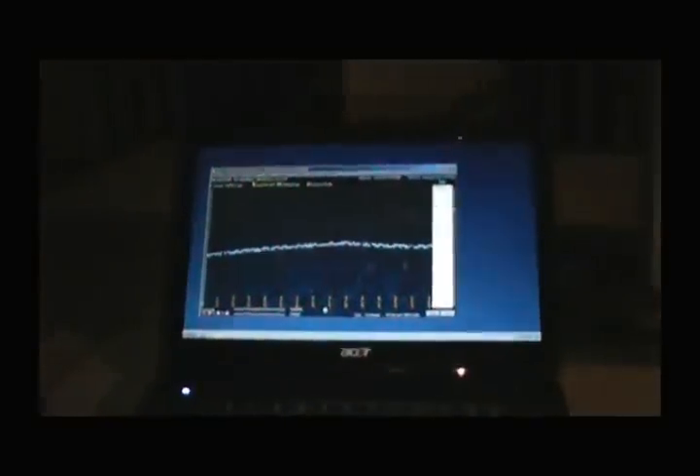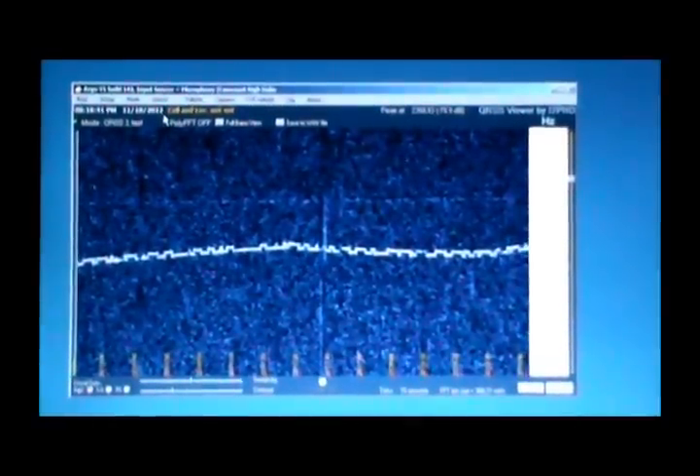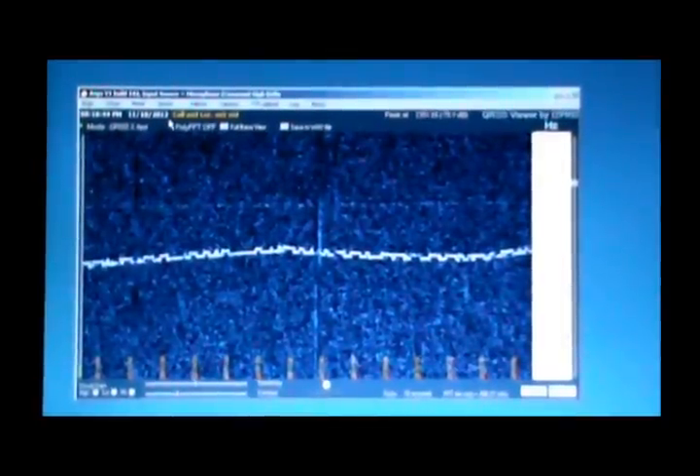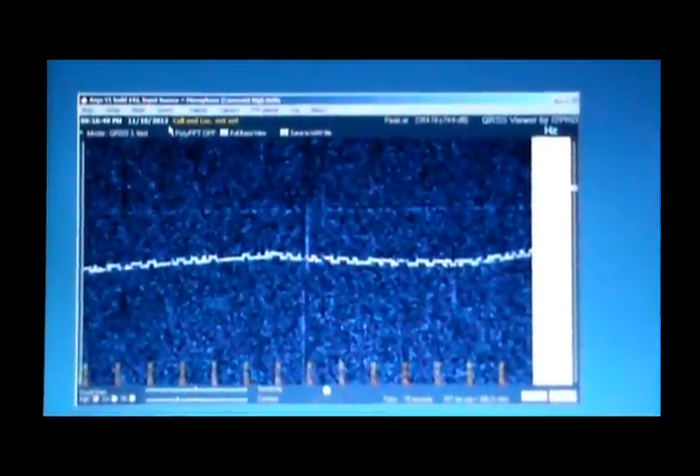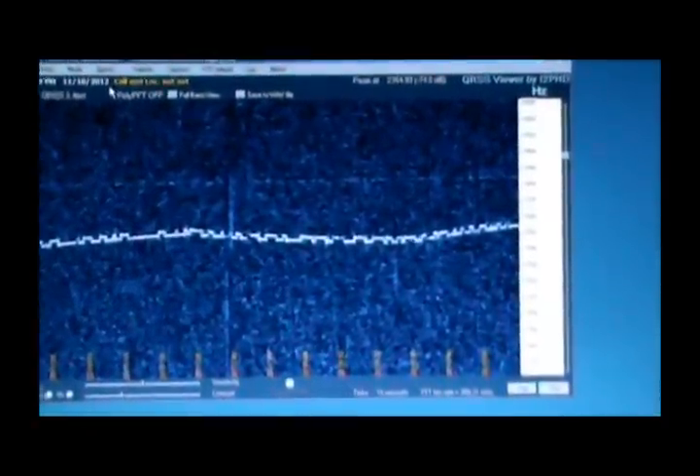So I was here testing this receiver prototype, and I decided to turn it to the QRSS calling frequency, and sure enough, this thing is able to read pretty darn good QRSS signals. Now, there's a little bit of fluctuation in frequency, and I think that is a combination of my transmitter changing its temperature as it warms up — I just changed its frequency not too long ago. But also, I'm going to argue that this QRSS transmitter is drifting a little bit, because earlier I saw it and compared it to a CW signal, and the CW signal didn't drift very much, but this particular transmitter did. So I don't think this drift has to do with my radio. But either way, you can see that it's sensitive enough to pick up QRSS at nighttime on 30 meters.